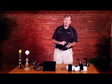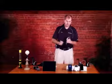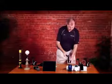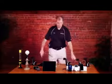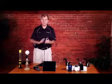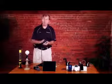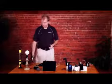We're now up to step six — you're ready to start charging your device. The most important thing is to crank fast, at least two cycles per second. Let me demonstrate with this light bulb where it's very easy to see. First I'll start charging slowly — you'll see you're getting no light out at all. Now a little bit faster, and you can see the light bulb is flickering on and off intermittently. Now full speed — full brightness. This is an 11-watt bulb and this is a 10-watt generator, so you can see you need to go at full speed to get full power.